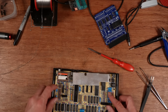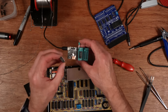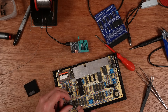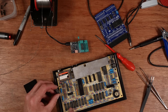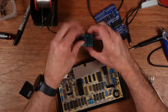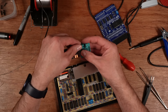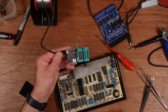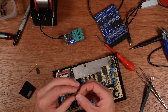Let's get a chip to go in there. I've got a 4116 here — it's an STC, the same brand as these ones. It's a slightly different silkscreen — these are from '84, week 23. Oh: 27, 23, 27, 27, 27, 27, 27 — they are a bit of a mix. And this one is 84/49, so it's close enough. Make sure it works — four blue lights on these is a pass. Yes!